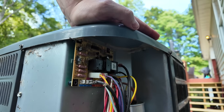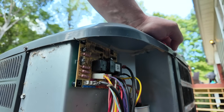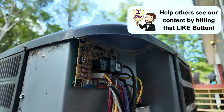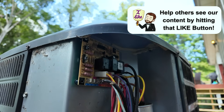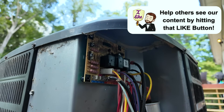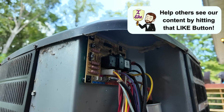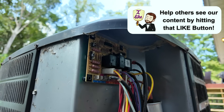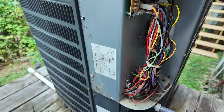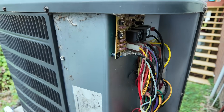We've got our control board up here. On these single-stage systems, the control boards are basically a bunch of switches on the inside with some timers. You've got defrost that needs to be controlled, some limit switches inside the unit, a high-pressure switch, a low-pressure switch, a defrost sensor, and the board itself that operates when the heat pump goes into defrost mode — which engages or disengages the reversing valve. Very basic overall.